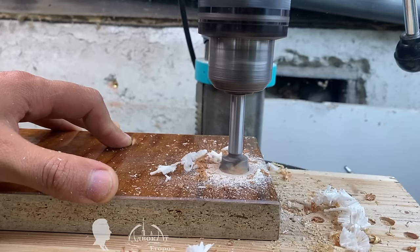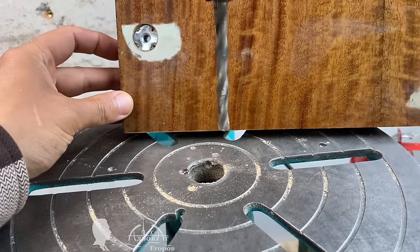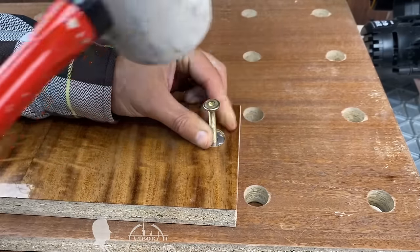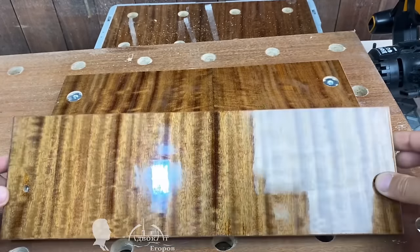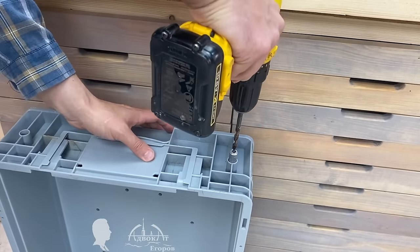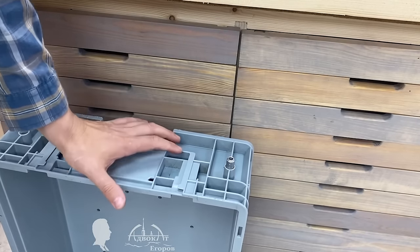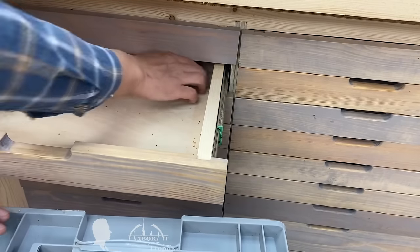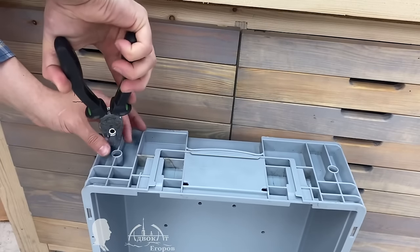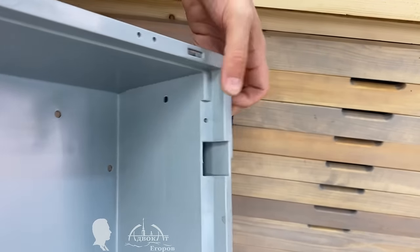The first step is to secure a piece of the countertop on the vertical wall of the KLT box — two attachment points will be sufficient. Two screws will securely fasten this MDF through furniture insert nuts, but these nuts should not protrude beyond the dimensions of the workpiece, so you need to drill seating recesses for them. Two of these MDF pieces need to be made. In the sides of KLT boxes there are special cylindrical protrusions, and if you make a template to drill exactly in the center of these protrusions once, then all of your boxes will have absolutely identical holes. This will allow you to freely interchange parts on different boxes and join boxes with perfect geometry. It is better to do everything precisely once than redo it later.